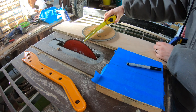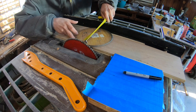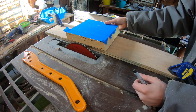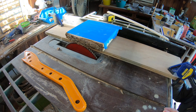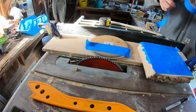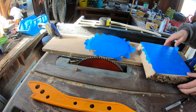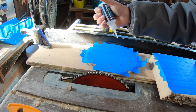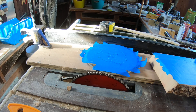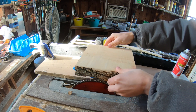I'm going to get a measurement here — I want the wood to be a certain distance away from the blade, about four inches. I don't want the lazy susan hardware to hit the saw, so I have it back a little ways. We'll tape that up as well, then I'll put CA glue on one side, spray the activator on the other side, get it set in place, and press it down for a few seconds for a really strong hold.